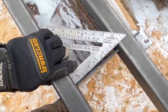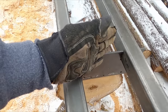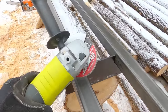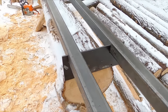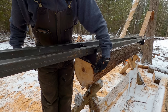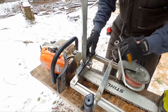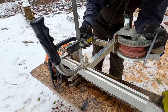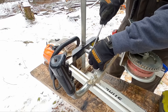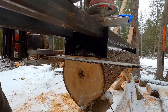The end of the log is not quite square, but because the cutouts are a little bit bigger than two inches, there's enough slop that the plate can be slightly off and it doesn't matter. These plates are just mild steel — it only took a disc or two to cut them out with a battery-powered angle grinder. Now with a five-inch plate plus another half inch sticking up — five and a half total — that'll be the setting for the first cut on the chainsaw mill, just to barely squeeze underneath the plate. I slide it up to five and a half plus a hair just to make sure I don't nick the bottom of the plate. Then the rest is just cutting — it should just clear the bottom there. Perfect.